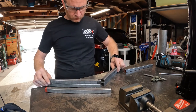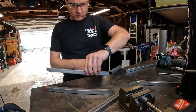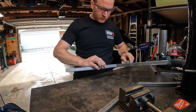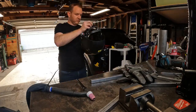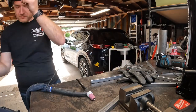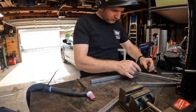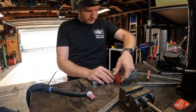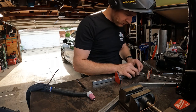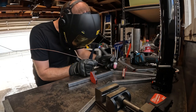I toyed with the idea of just using some pipe riser clamps, but the 180-degree nature of those would have meant extra material, a fourth leg, and that would have over-defined the flat base — a little more complicated. And this gives me a chance to weld. In the end, a few square tubes, a few pieces of flat stock, and a will-call order from McMaster for the three-inch tube, and that'll get me a set of jacks for under two hundred dollars all in.